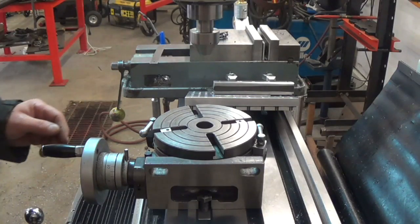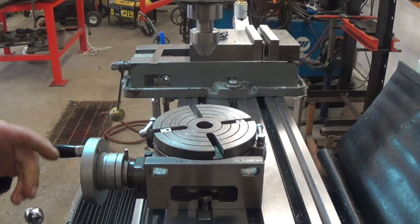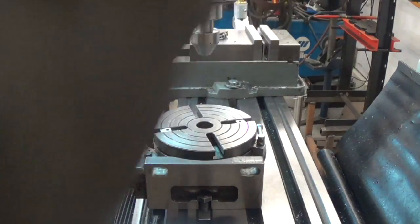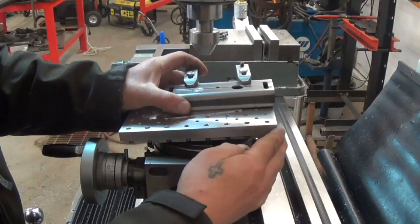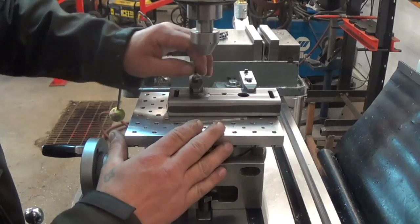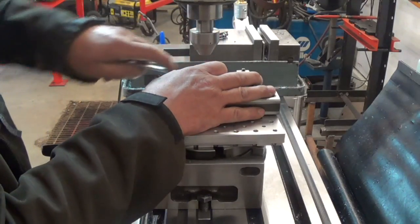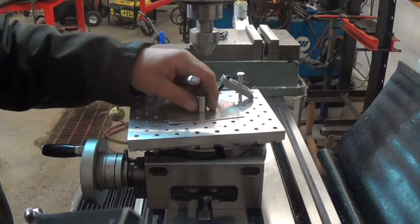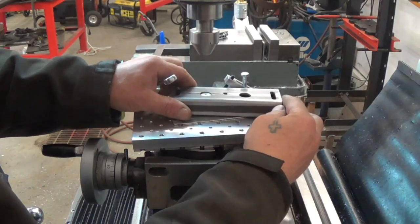Good morning here in the shop. I'm going to take a few minutes to run through this setup to do the radius on the tubes. The shop noise is going to start soon, so I've got a rotary table set up roughly centered here for now. We'll dial it in in a bit. I've got planned to attach my mini pallet to it and we'll center up on this pin in the center. We've got a 5/8 pin centered in the rotary table, so we'll dial this one in concentric with the spindle to which we'll add our roller tubes.